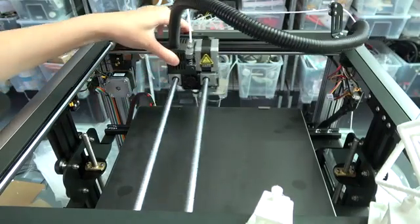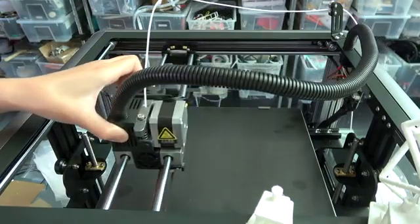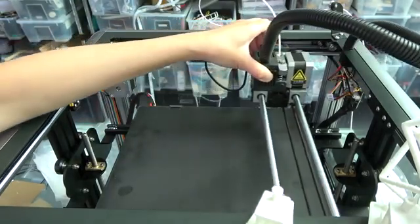But all that time and hustle gets you a very strong rigid frame for not a lot of money. I have to say I really like how it came out — it's stiff, it keeps straps out, it looks nice. Just use an electric screwdriver. Then we move on to the mechanics, which are a little weird. XY movement is done with a replicator 2 style gantry. This is a well-proven 9-year-old design that's still used by countless 3D printer companies, most notably FlashForge. It uses rods instead of Creality's usual V-slot, but it's very reliable, easy to repair, and makes for high quality prints.